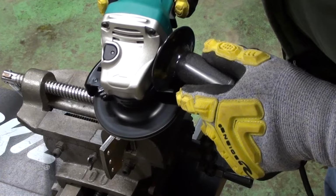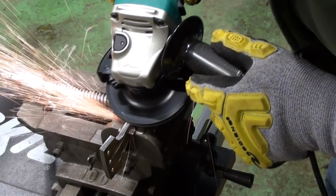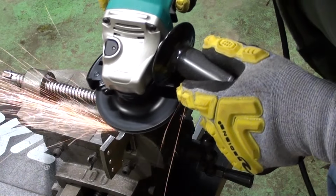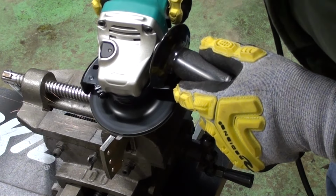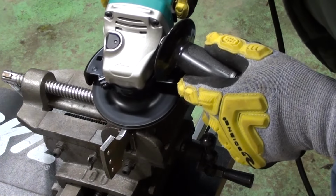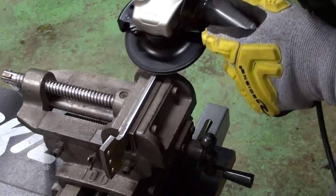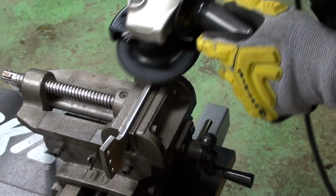Parts were then cleaned further with files, sandpaper, an angle grinder, belt sander, and a rotary tool with various bits. Be certain to follow good safety practices, including gloves, safety glasses, and dust masks when appropriate. Edges are eased slightly with files and sandpaper to reduce some risk of paint chipping.